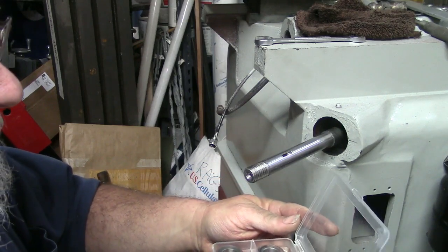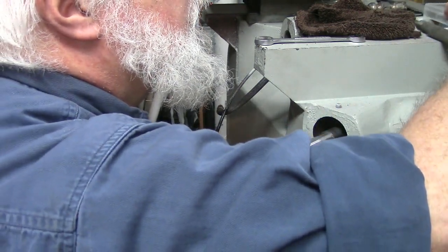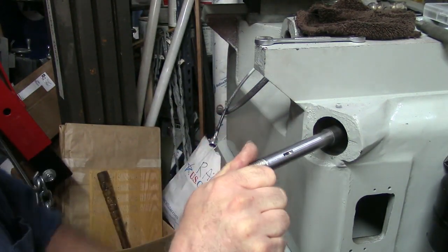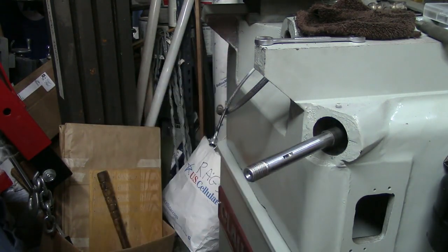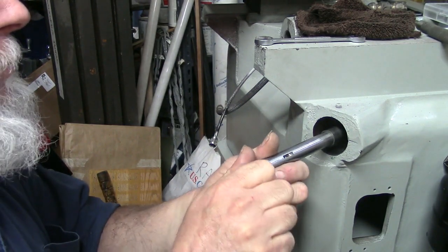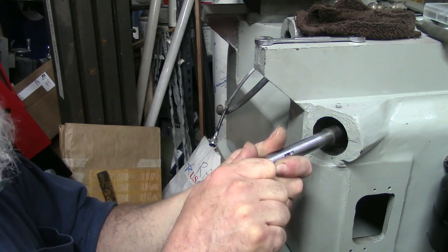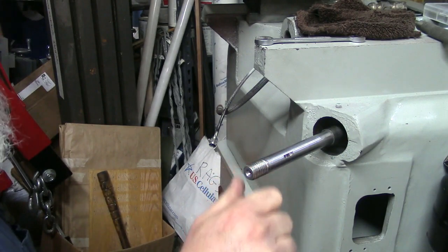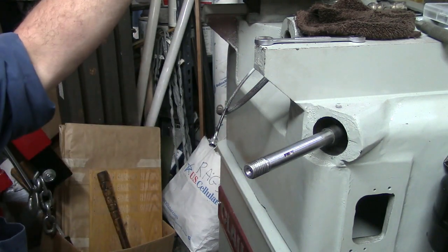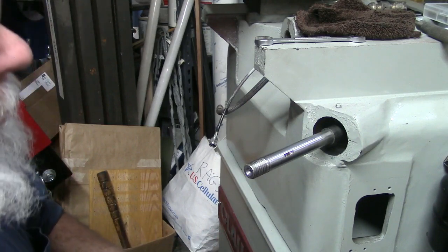and the mesh, or the backlash for this bevel gear, is well, slightly adjustable. I cannot absolutely get the play out of it. I cannot seat that bevel gear so that there is no play between the two bevels. But I do have to get the play out of these bearings, which will be in here.